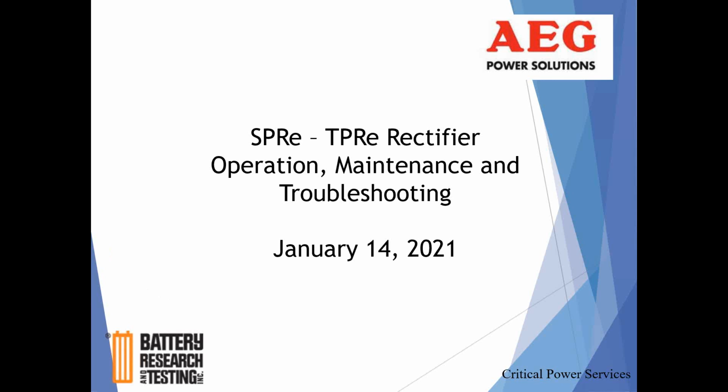With regards to AEG power systems or AEG-PS rectifiers and/or power supplies, or sometimes you'll even hear them referred to as battery chargers, those terms can be used interchangeably. The SPRe and the TPRe rectifiers are the installed rectifiers of choice for Avangrid, for RG&E and NYSEG. The S indicates single-phase units, and T are three-phase rectifiers. So we're going to go over the operation, maintenance, and some basic troubleshooting.